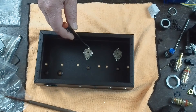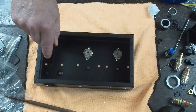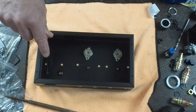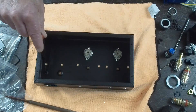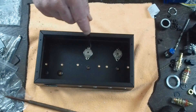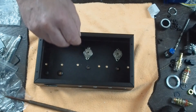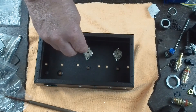The wiring is going to come out, over, and then here is your filament voltage coming out of the transformer. The other thing we need to do is reference the heater windings to ground, but I'll go over that when we're working on the wiring itself. So the critical thing at this point, when we're getting ready to punch these holes for the tube sockets, is where they're going to be located and how they're going to be oriented. We want them in front of each output transformer, with the heater pins facing forward.